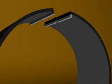Time-saver's design starts with a solid steel backing that ensures a precise fit and dimensional stability throughout the life of the blanket. Next, a solid steel hold-down angle and an exclusive solid steel lock bar are welded to the metal backing. Highest quality urethane is then form-molded and precision ground and trimmed for precise dimensional accuracy.